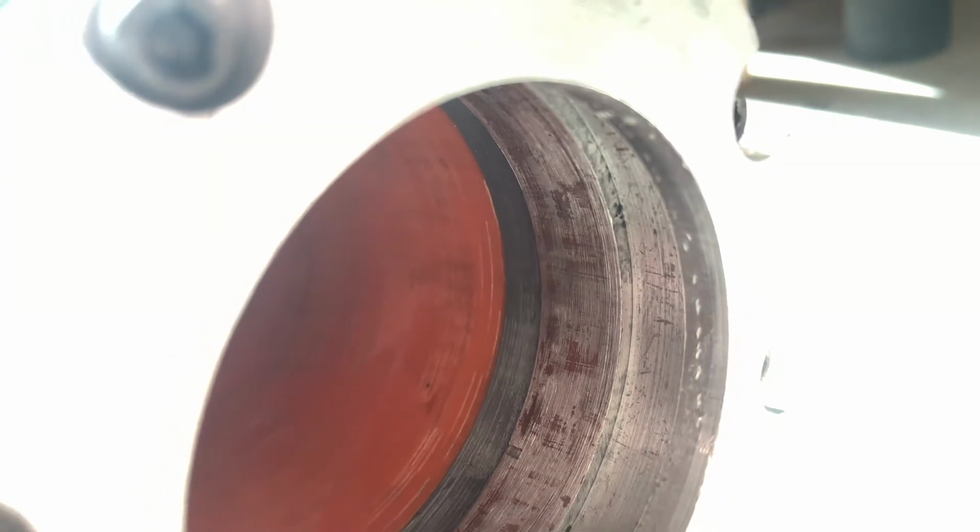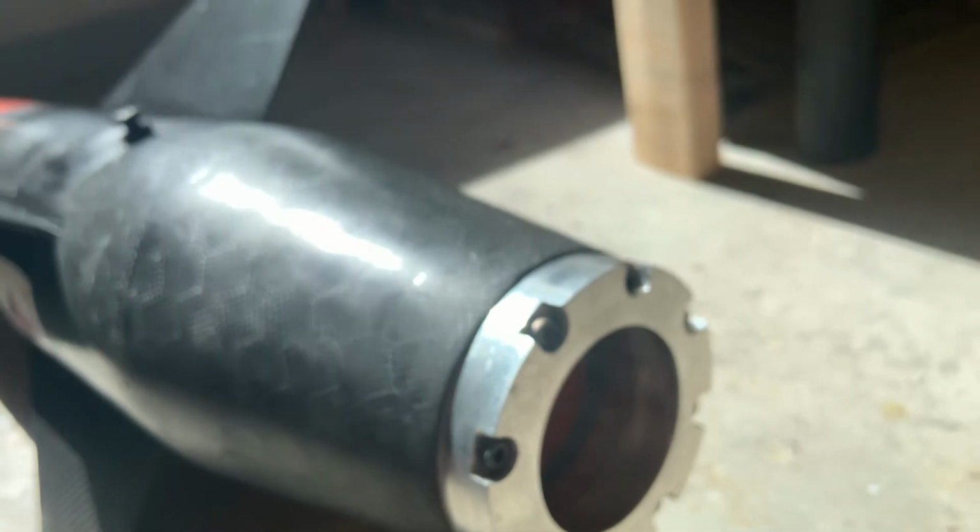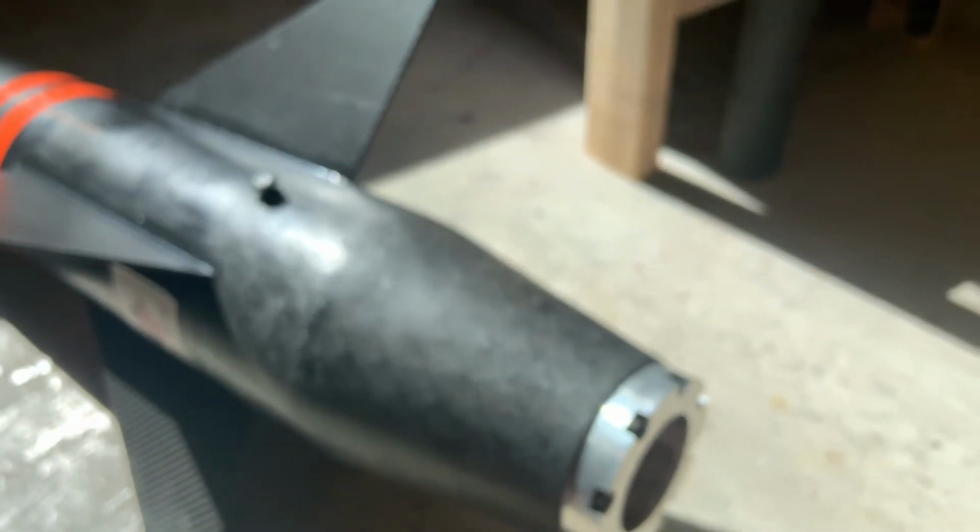The aft body tube is then used for the booster section, and it's integrated with a carbon fiber boat tail. The boat tail is manufactured through a traditional wet layup process. The truncated cone pattern that the boat tail is constructed off of is unfolded in order to prepare templates for the sheets of woven carbon fiber to be cut out of. The weave is placed over a plug which is designed to be left in the structure. That weave is then saturated with epoxy following a similar post-processing technique as the body tube.